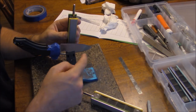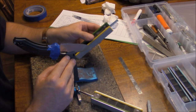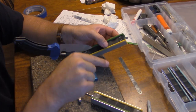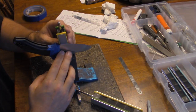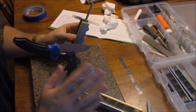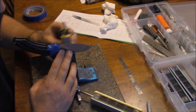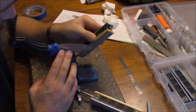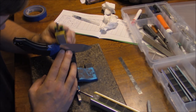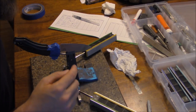Some tips: when you get close to the edge, pay close attention. I've slipped off a couple of times and had the blade knife right into my thumbs — I've got considerable scarring on both. So definitely take your time, especially if you're learning to use the Wicked Edge for the first time.